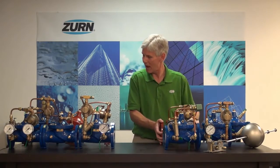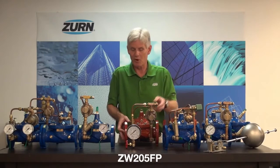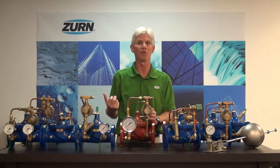We also have our ZW205FP. Like the domestic ZW205, this is a pressure relief valve. Typically it's going to be used on the downstream side of a pump. In the event that the fire protection system stops its flow rate, we could go over pressure. This valve will control that pressure and dump the excess back to pump suction so that we're circulating, ensuring we don't over pressure the downstream in a fire protection application.